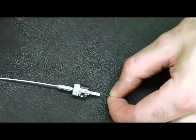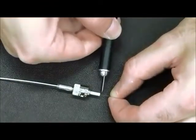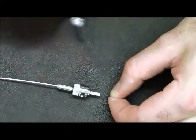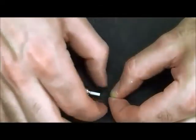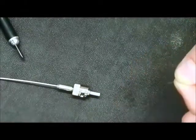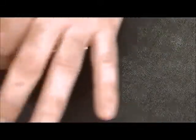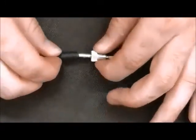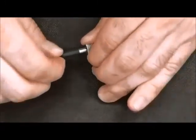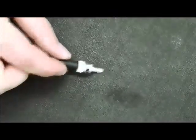Now using a hand scribe, we will remove the fiber optic cable that is coming out of the ST connector. Gently pressing against the fiber and pulling away from the ST connector to see if you can remove the fiber. If you cannot, try cutting against the other side, not cutting in a saw motion. Then slide the small bend limiter onto the crimping ring all the way against the ST connector.